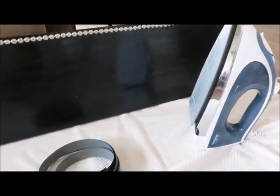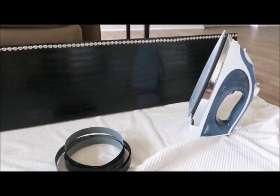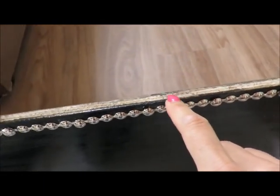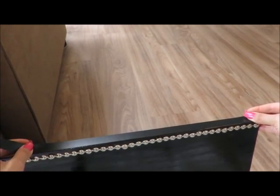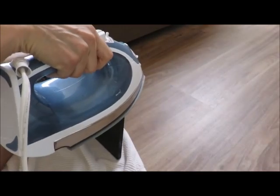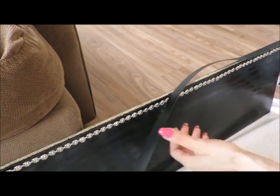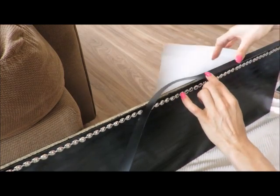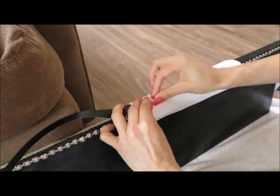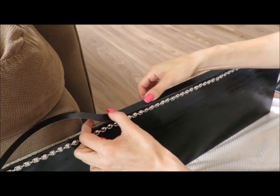Now we're moving on to the edge banding tape. We're going to use this to finish the edges of the plywood. This is the same stuff used to make IKEA furniture, so it has an adhesive that is easily applied with the iron. The unfinished edge is jagged and you don't want to cut yourself on that. Hold it in place lining up the edge, and on the cotton setting slowly move the iron down the board. If you find that glue is coming out of the edges, place a piece of paper over it and slide the iron down — this will keep the glue from getting on top of the trim.